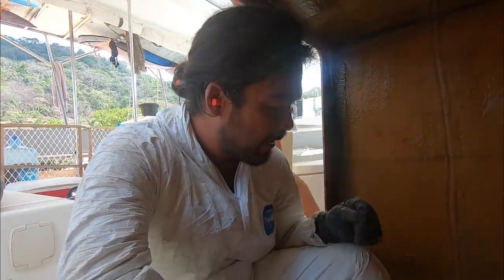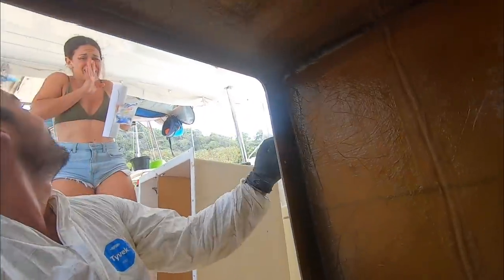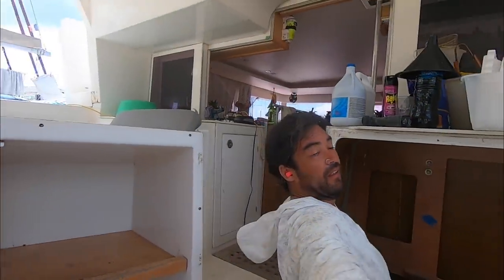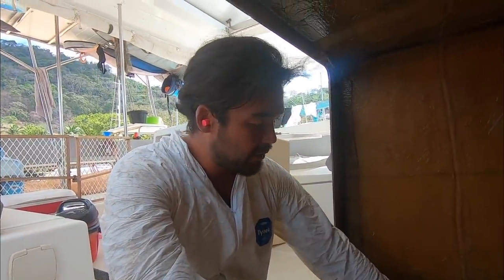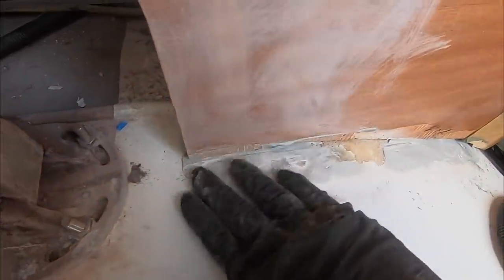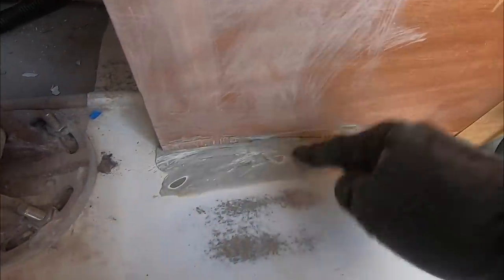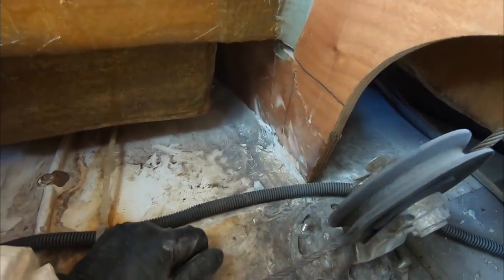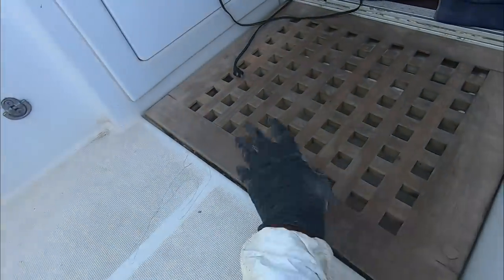Now that's all done, I'm under the salon doors. I'm taking this cabinet out and the last of the glue we have to get out is just down here — tight little space. Hopefully my multi-tool will fit. We want to use the multi-tool and then quickly grind that down to the fiberglass so our new glass will stick to fiberglass and not glue or gel coat. I've got to get in here — it might be a bit too tight.